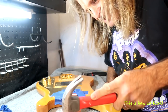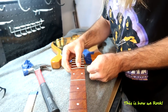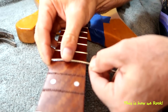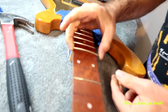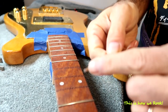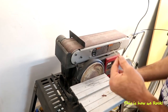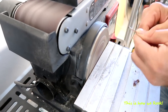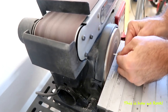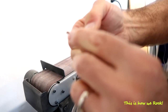When you hit it, the head of the hammer needs to hit it like that. If you hit it the wrong way, you're going to make dents. When I cut these, I kind of leave just a hair over and then snip it right there. When you snip these, it kind of messes up the tang a little bit, so what I do is just hit it with the sander real quick. There — now those tangs are nice and straight.